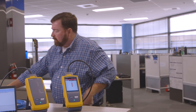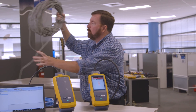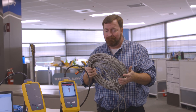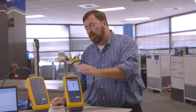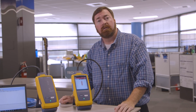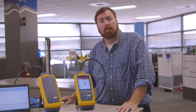So why did this cable have resistance? Well, picking it up, we'll notice right away — boy, that cable's not heavy enough. Copper-coated aluminum. It's garbage. It's not acceptable for the standard, you don't want to use it. The new plus PoE limits in version 5.6 will make it easier for you to specify to your team, or for you to run tests and deliver results to your customer, that are reliable.